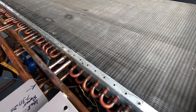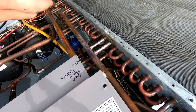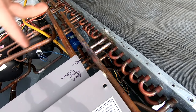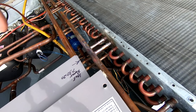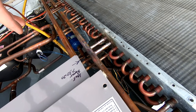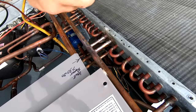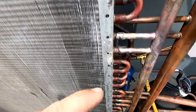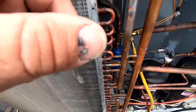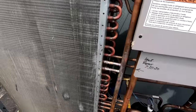I'm doing this to help some people out — is it the 100% correct way? No. You should pull it out, change the filter dryer, pull a vacuum, and spend another 3-4 hours. For as concerned as everyone is about doing things that cost the customer money, I wouldn't think they'd have anything to complain about. This has been repaired, it should not leak now. All this oil down here is from that little leak up there — the fans just pull it and fling it everywhere.